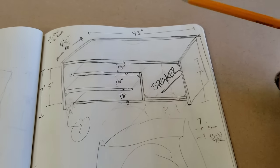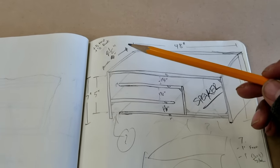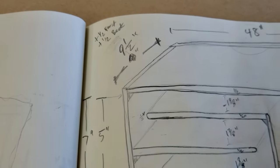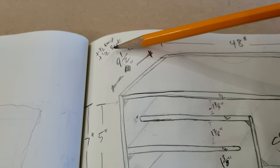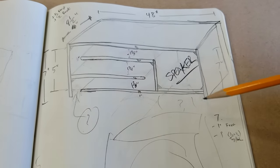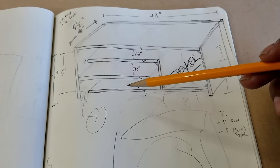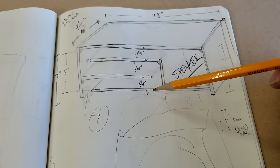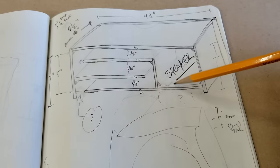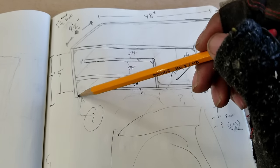is going to measure roughly 48 inches across. It'll be 7 inches high, 10.5 inches deep. Ignore this. This says 9.5, but when you account for the front and the back covers, it'll measure 10.5 inches deep. I've excluded an inch from the bottom, which would leave 6 inches. 6 inches will be divided equally among the lower baffle, top cover, and the two boards here that'll help guide the airflow out. So again, the speaker, airflow in and around and down.